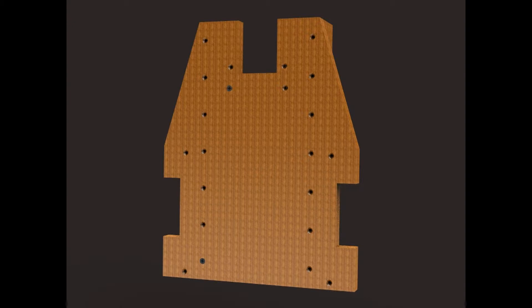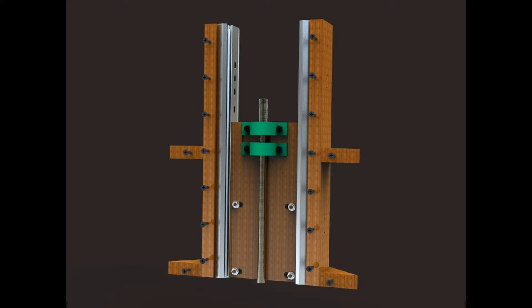In the next set of shots, you will see how the actual screws attach our back plate to all of our uprights and stability angle brackets — screwed together in a specific pattern. This pattern ensures that it is straight, true, and accurate. Any variations in how our slides move up and down will ultimately show up as tolerance variations in our finished part. The more detail we have here, the better our ending parts are going to be. With the backing removed, you can see where all of the screws place into the uprights and stability angle brackets — ensuring everything is straight, plumb, and at right angles. Right angles are important when dealing with a z-axis.